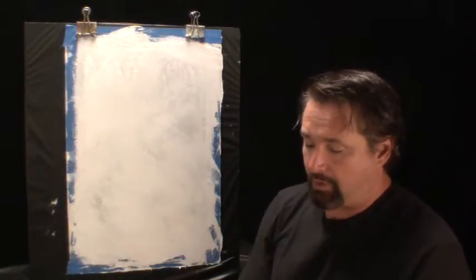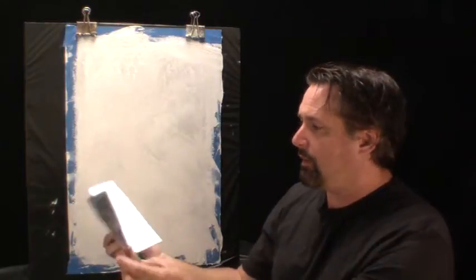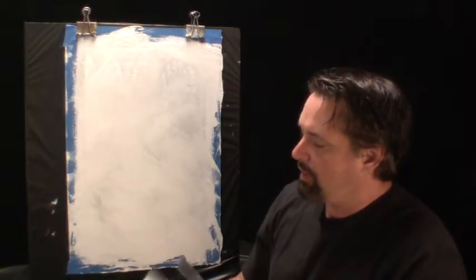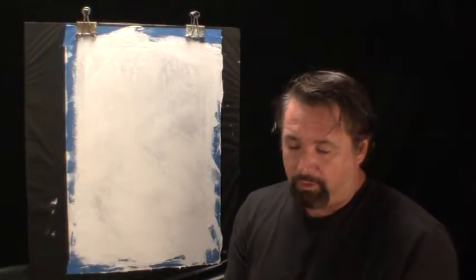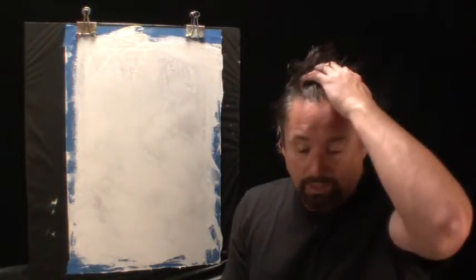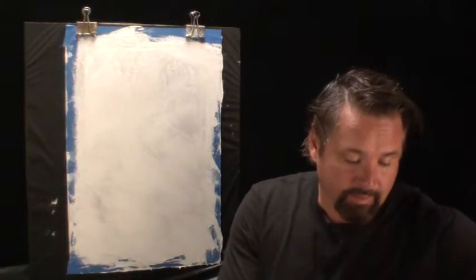For the grasselo plaster, our good Venetian plaster trowels, the high quality stainless steel Pavon trowels, with our spatula. They're a little damp because I just rinsed them off. Somebody forgot to clean them up after the last use. But that's it. Grasselo plaster is an interior-exterior lime-based plaster. It's lime, cleaned up with soap and water. It tints with lime-compatible pigments, not paint, not regular universal pigments, because the lime in the product can have an adverse reaction to most pigments, and it'll destroy it, and they could fade out overnight. This color has been tinted to a Sherwin-Williams color called tricorn black. It's a deep, dark, cool color.